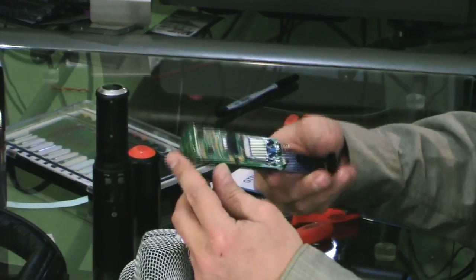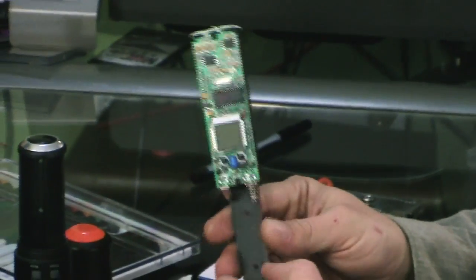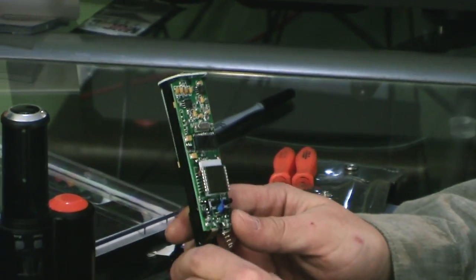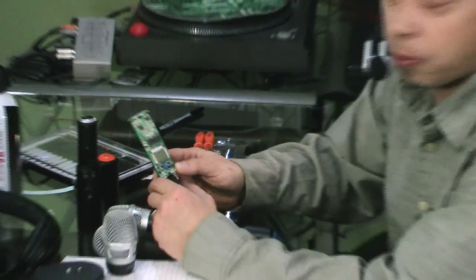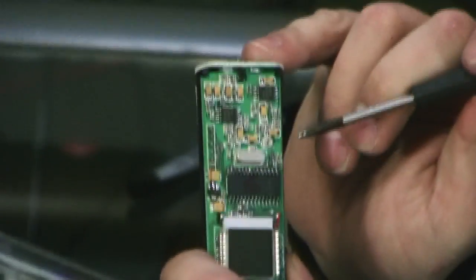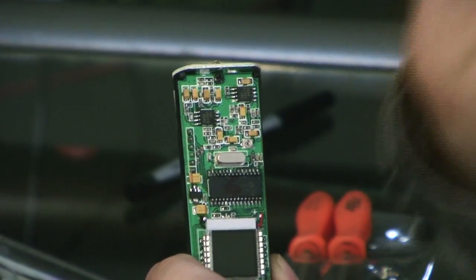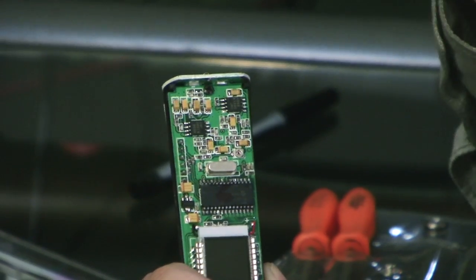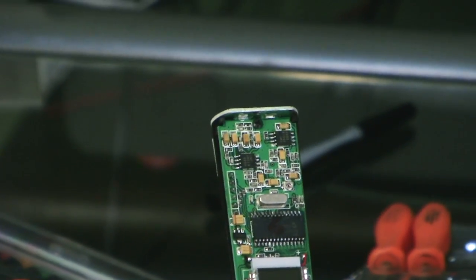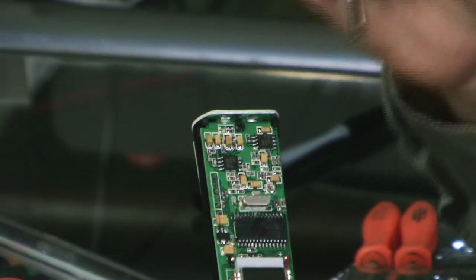Inside there's not a lot of adjustment options — we have a few small chips here and there. The problem is that the menu does not provide an option for adjusting the gain on the microphone, at least I didn't find one. However, I found one small resistor over here, which as I understand it appears to adjust the gain. We experimented with the receiver and transmitters together, and they do adjust.